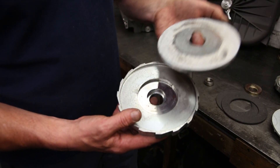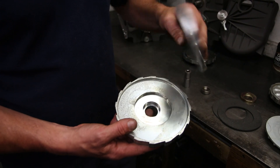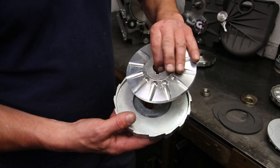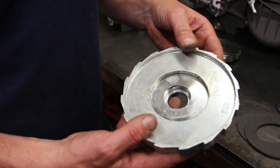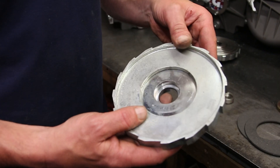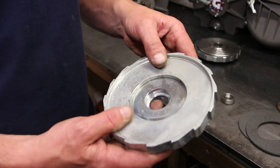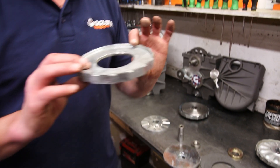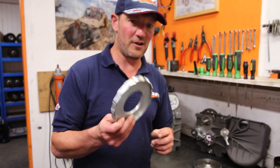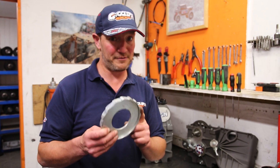What we did is improved a few different things. We changed the material — much harder. We also changed the number of teeth around the outside and went through a lot of effort and heartache to get exactly the right working ratio. We found this has to be hard — if it's not hard, the teeth wear off very quickly and you're in a world of pain.